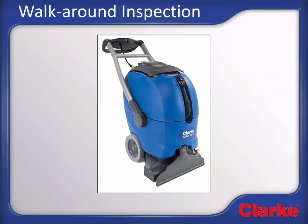The final inspection step is to give the machine a quick walk around and look for anything that looks worn, loose, damaged, or leaking or out of place. Also, give the power cord a good review to assure it is not damaged in any way. Address issues found with the machine before using it for cleaning.